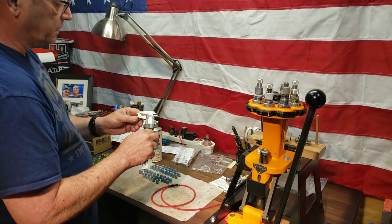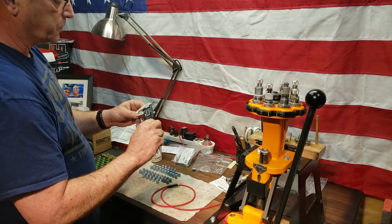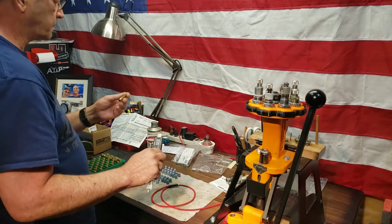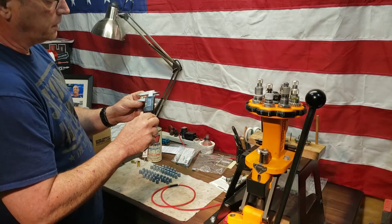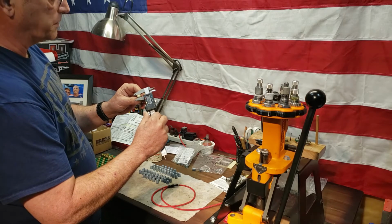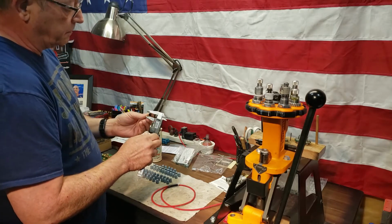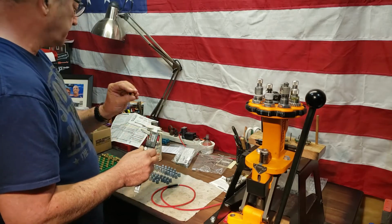They work. One thing I wanted to say is the head spacing, or the rim on these, is about .473. These are coming out about .473. The 45 ACP is basically the same diameter as your 308s, 30-06, 243. These are coming out right around .471, but they're supposed to be .473. Take it for what you will. These are fired. The rest of these I've already run through my sizer, and I'll show that. These are coming out about .471, .472, somewhere around there. These haven't been sized yet, so they're not perfectly round.